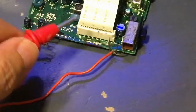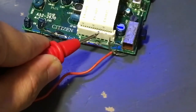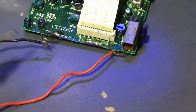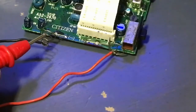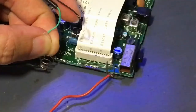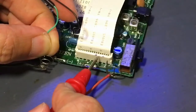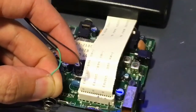Notice the black markings here — this one, this one, and this one. There are three black markings which I have deliberately marked. These three pins are the ones I should avoid because they have continuity with ground, so there's a possibility that if I connect ground and then try to tap the signal to one of these three pins it will cause a short circuit. I'm going to avoid these three pins for safety. I found out which pin actually gives the composite video out or AV out — this one here. It happens to be in between the two pins I should avoid, so that's easy. To prove I've got the AV out, I'm going to output it to the TV, and here I'm going to connect to that pin.